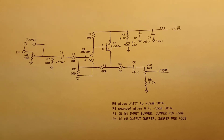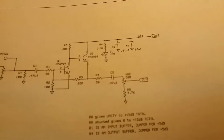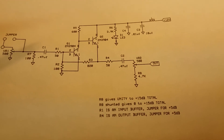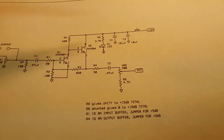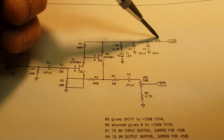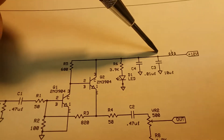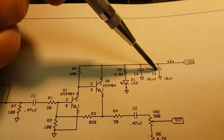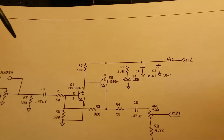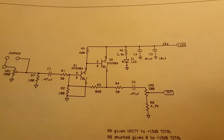There's a schematic — you've seen it on the channels before. What I have to add into these two units now: they were built for testing and I was going to put the filtering components external, but on second thought I'm going to build them in to keep everything together. I'm putting in an input choke here to keep the VCC — the V-plus line — nice and clean from RF, and we're doing some DC bypassing and RF bypass as well, with a high-pass path to ground to keep everything nice and clean RF-wise.